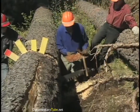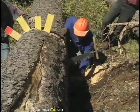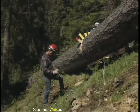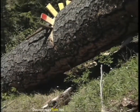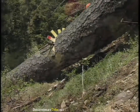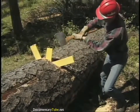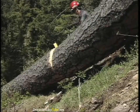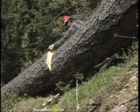Then as you cut through and get close to where the log may shift or may fall through, usually you take the handle off of the downhill side, or whichever side has become hardest to saw from, and let one person finish the cut. And that one person finishing the cut should use just the teeth on the end of the saw. And if the saw does drop down into the dirt, you're going to dull the end teeth, which don't matter quite as much as the middle teeth.